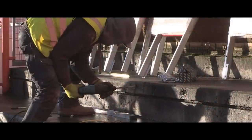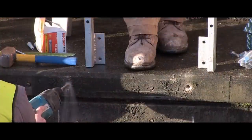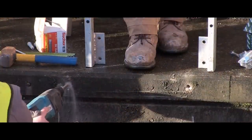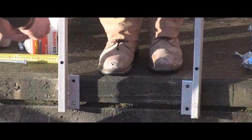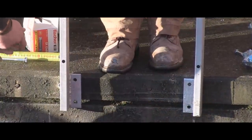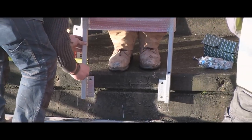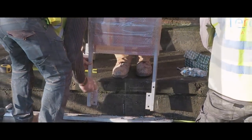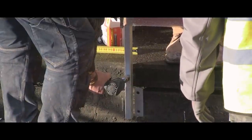Once this is completed, the first holes are drilled into the concrete step and the fitting begins. Using heavy duty reinforced drill bits to cope with any internal concrete reinforcements, the holes are then aligned with the rail seat and secured using M10 95mm through bolts. The bolts have a hot dipped galvanised finish to match the rail seats and to better withstand the weather.